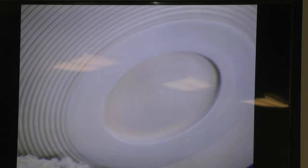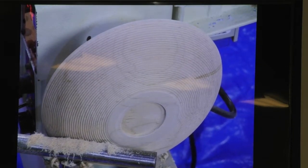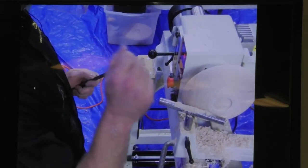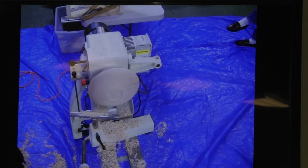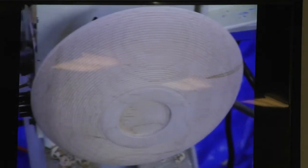So that's the outside. Okay, how do you sharpen that tool? Carefully. You turn your grinder on, let it get up to speed, turn it off, and as it's decelerating, just barely touch the tool to the wheel. It doesn't take a lot to sharpen them. Is it carbide? No, high-speed steel. Whatever steel D-Way uses in his tools. D-Way is a manufacturer? Yeah. Not necessarily a supplier.